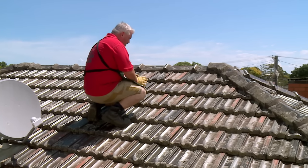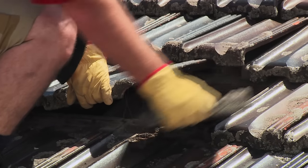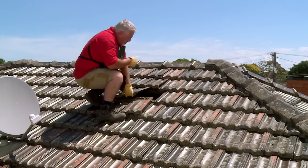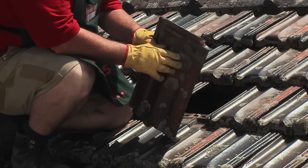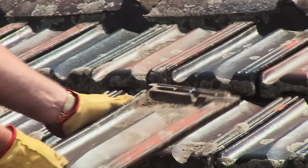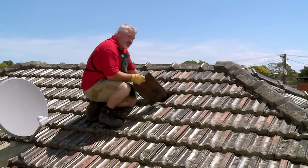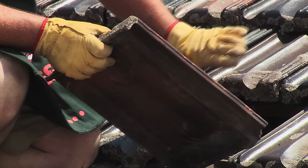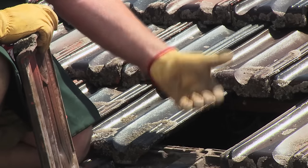I've selected the tile I'm going to take out. The best way to do it is hold the opposite tile up, and as you're holding it up, lift your tile out and expose your opening in your roof. Sometimes when you're taking your tiles out they are nailed at the top, sitting on the batten. If you lift the opposite tiles and your tile won't come out, you're going to have to push the next lot up to expose this edge of the tile and pop the nails out.